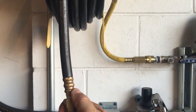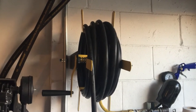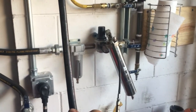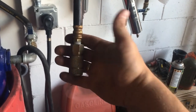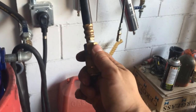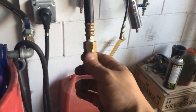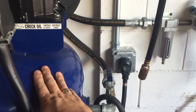Here's my reel with a 3/8-inch — I believe — hose. This one is a 50-foot on my reel. It's just a hand-cranking reel, but it does the job very well. That's what I use with all my air tools — from impact wrench over to paint guns. For painting, it's very important that you have less water in your system — the less water you have, the less you get into your paint.